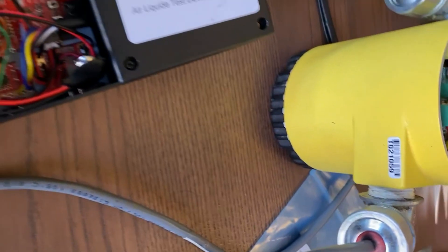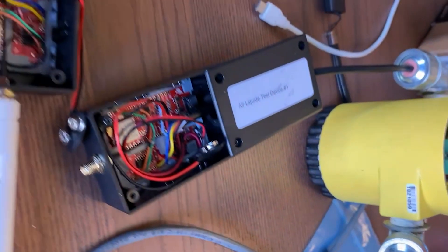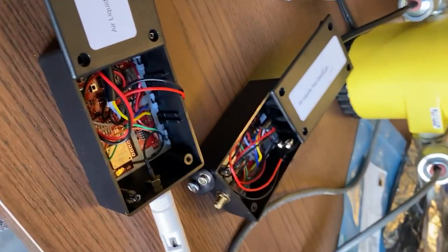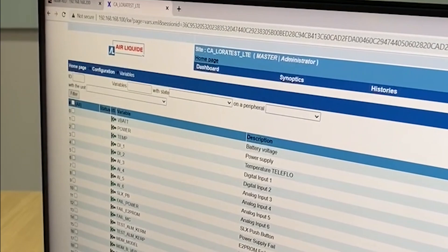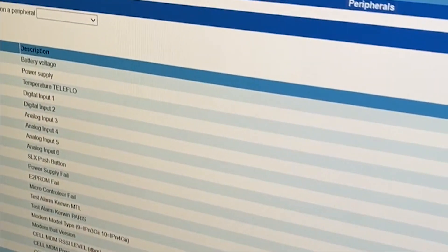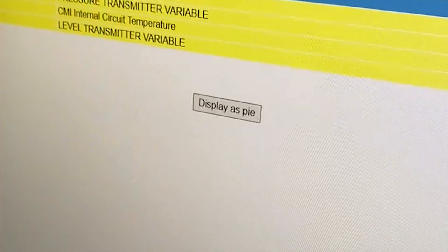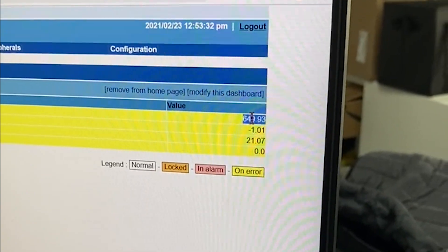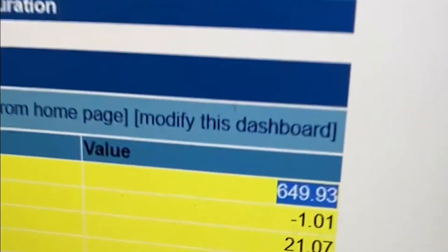We built this proof of concept ready for future capability. Processor utilization is very low, so it's open to experimentation on edge processing and machine learning applications in the future. The gateway provides a unified dashboard view of several remote sensors and presents it as a single virtual Modbus device for the Air Liquide team to use for operations, analytics, maintenance planning, and any other systems that can benefit from the remote monitoring.